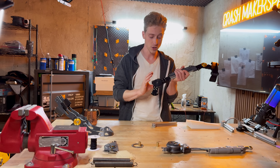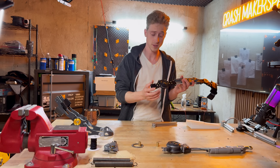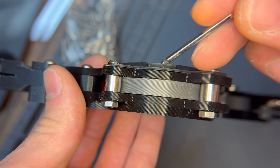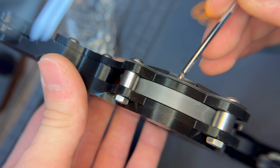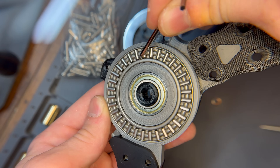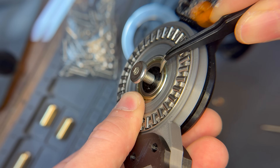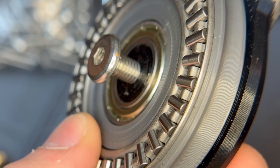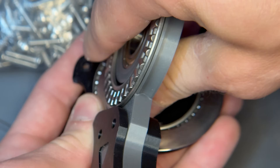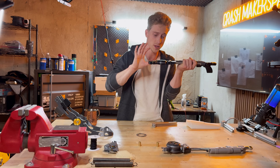I'm going to try to have the hinge itself actually be part of the armor system, since it's hard to put armor around moving parts — I'll shoot it and see if it can stop some rounds. These hinge joints have three primary layers: two outer layers bonded to the upper chassis and a lower armature sandwiched between two roller pin bearings to reduce friction. There's an axle sleeve on the inside connected to the lower part, with just 0.1 to 0.2 millimeters of variance — adjusted so it's just barely holding tight when cranked down without causing any friction. They're very loose while having no wobble whatsoever.